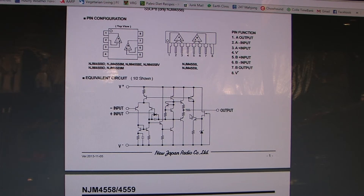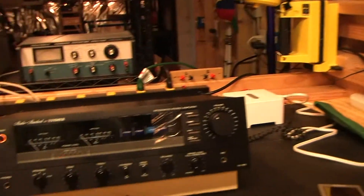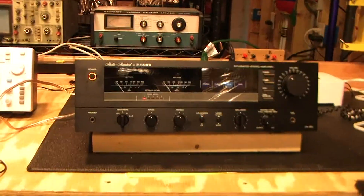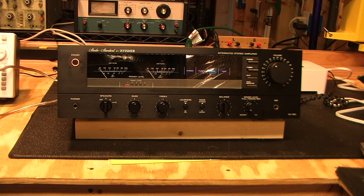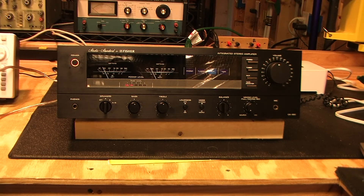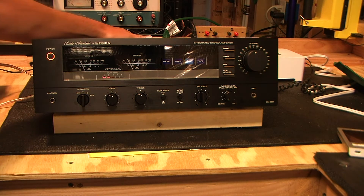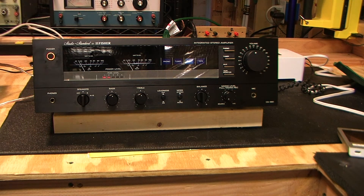So we have covered the basic design, and now it would be a good time to start some of the tests. Very fundamental tests, nothing sophisticated. I've been running it now for over an hour intentionally, because I wanted to see how hot the heat sink would get based on outputting roughly about five watts continuously for over an hour. The heat sink is just moderately warm — just a little bit warmer than room temperature — and both heat sinks are at equivalent temperature. That's a good thing.